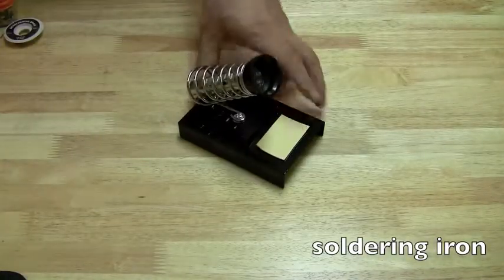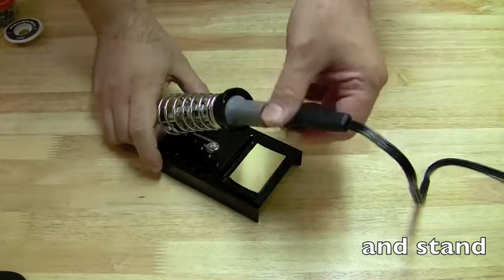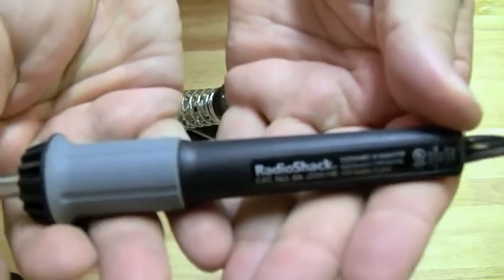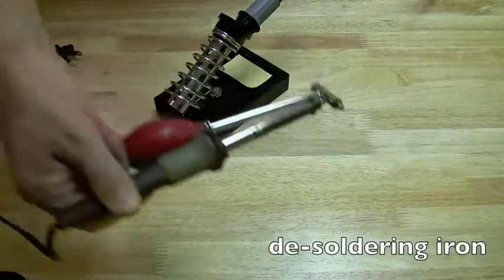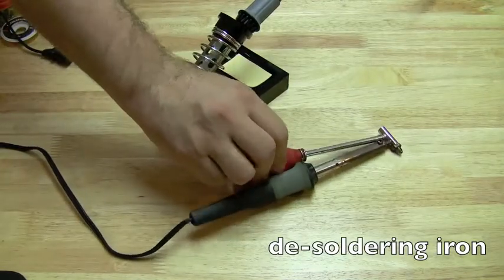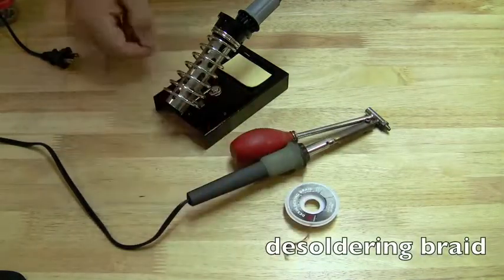A soldering iron is crucial. This is the soldering iron stand and that's the soldering iron I use — just a simple Radio Shack 15-watt soldering iron. It does the job for me. This is the model number: it's 64-2051B, and the stand you get that separate or sometimes they come in a combination. Another thing that's really wise to get is a desoldering iron, especially for power jacks. If you've got some stingy power jacks that don't want to become disconnected, you use this desoldering iron.